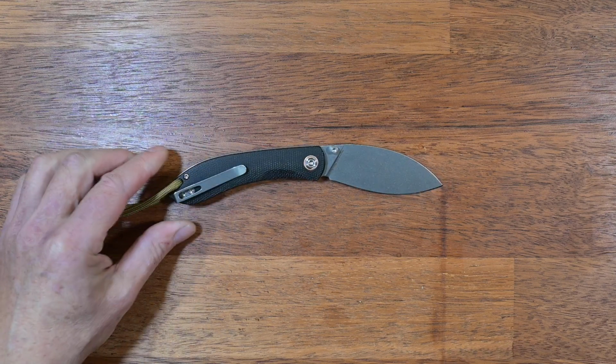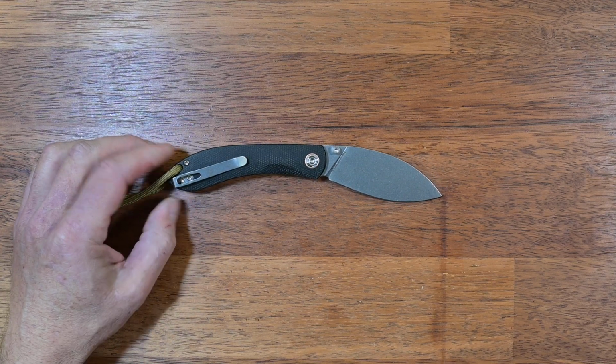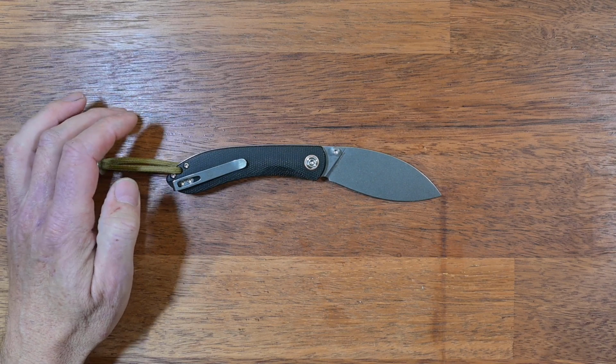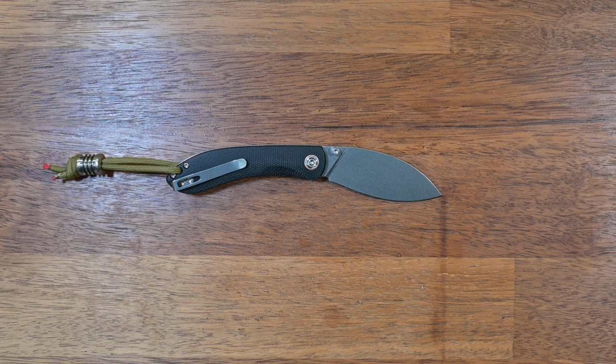Lags behind D2 and your other budget knife steels a little bit in terms of edge retention. If you're after edge retention, you're probably better served with a decent D2 or a 154 CM, but it's not a slouch either, and especially if it's hardened well and combined with a good cutting geometry, it can be an excellent knife steel for the money.